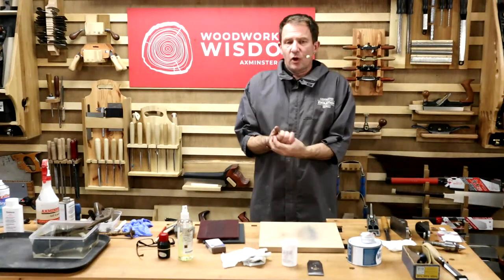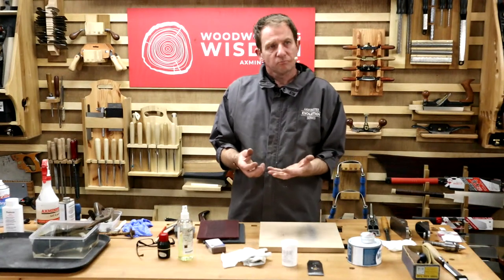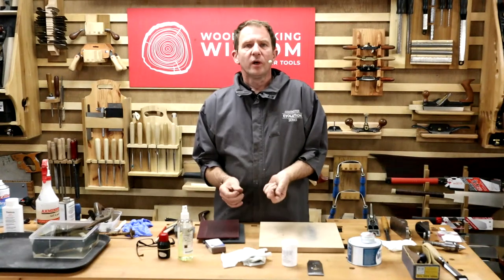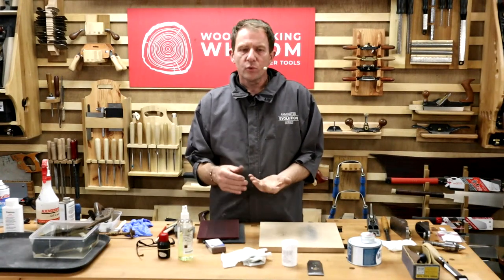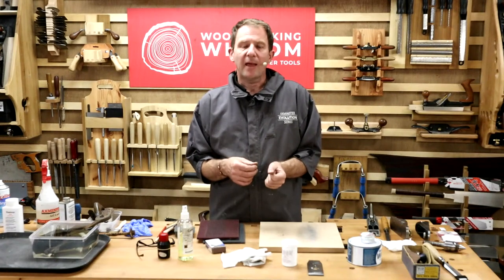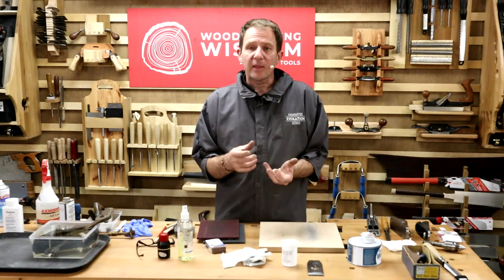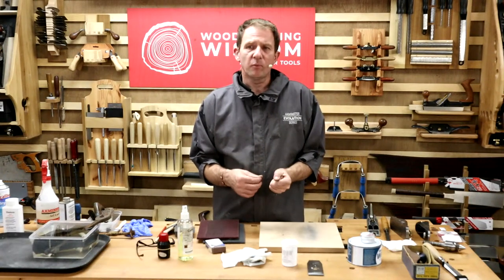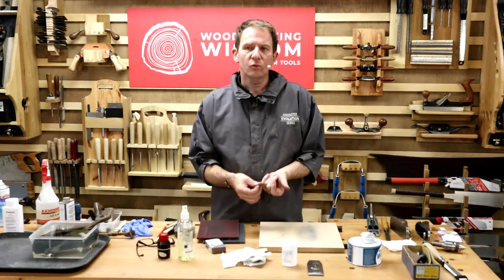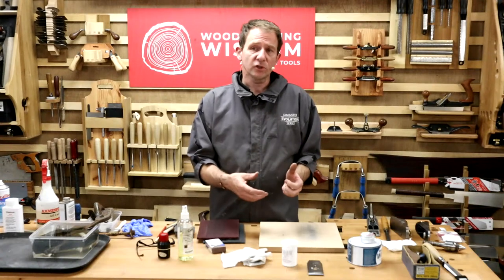Now, Maria, you talked about chrome things on the bed bars of your lathe. Most of our chucks are now all stainless steel. The jaws are stainless steel. Why do we do that? We used to, and the older chucks, if you have them, the K10, were a mild steel body, and then they'd go off to a chroming plant locally, somewhere we used to deal with, and they would chrome plate the surface. Now, the problem with that, from our point of view, is it's inaccurate. Varies in thickness. So we then decided, could we make a chuck out of stainless steel? That doesn't corrode, has that advantage.